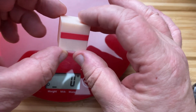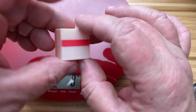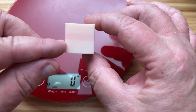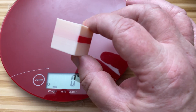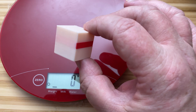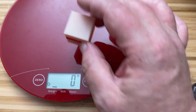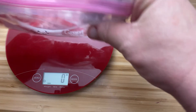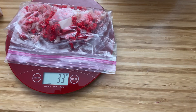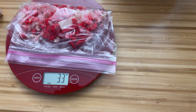The 1.0 multiplier block shows slight fading down the sides and some bleeding on both sides, but nothing on the back. Adding more walls — going from four up toward six — might take care of that. The weight is seven grams, consistent across all blocks. Waste including the purge block is 33 grams — compared to 36 grams at 1.3 and 22 grams at 0.5, right in the range expected.